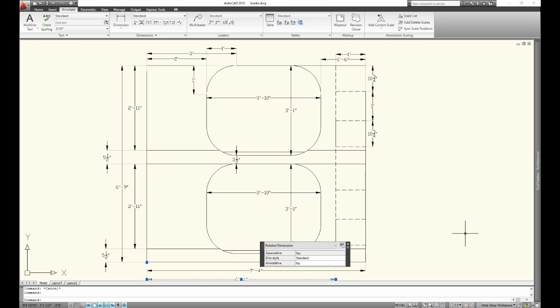For sizing, a normal twin mattress is 75 inches long; ours is 76 inches from end to end. We have an extra foot for the shelves, and if you remove the bottom shelf there's room for an extra-long twin as the boys get taller. The opening is pretty much three feet by four feet — we did three foot ten for the width, which is somewhat arbitrary. The corners turn over a one-foot distance, starting and stopping at one foot, giving a rounded edge. You can use those measurements to figure out exactly how to cut it.